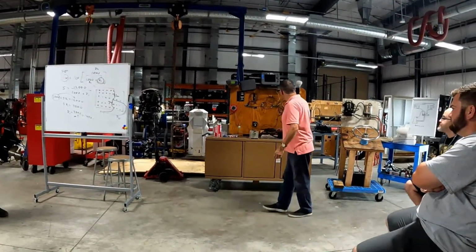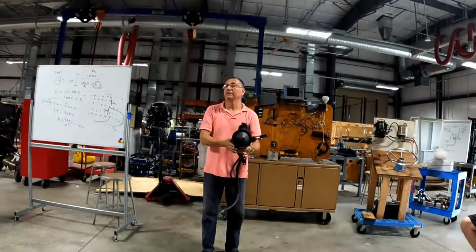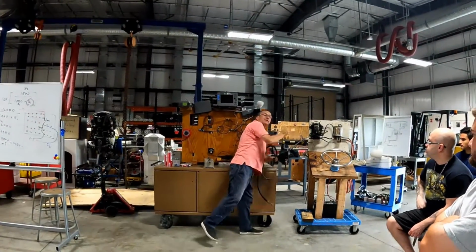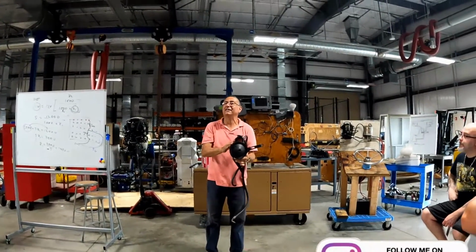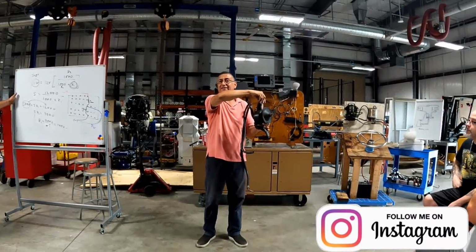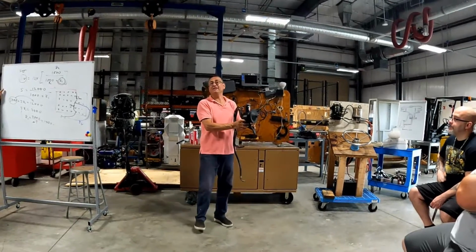Look at this. When you start the engine, you remember that pump in your car? Yeah. It's connected with the valve and the crankshaft. Power steering. And this one is connected to port and starboard on the actuator. Port and starboard. You see? As soon as you start that pump, look at the reservoir. The reservoir is here and the pump is here. It's integrated. Immediately the engine starts, you have fluid at high pressure because this pump introduces 60 psi.